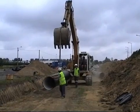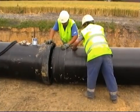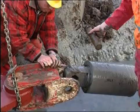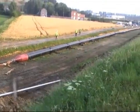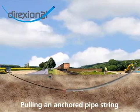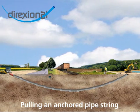In the last phase, the anchored ductile cast iron pipes are assembled outside the borehole using a pull lift or the bucket of the excavator to make a string of pipes. The pipe string is then pulled through the reamed borehole from the downstream pit to the upstream pit by the drilling machine.